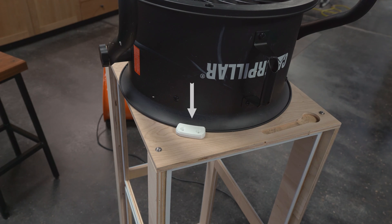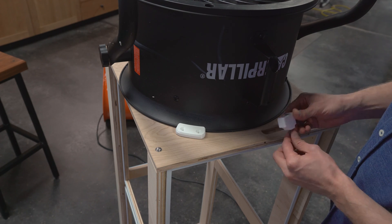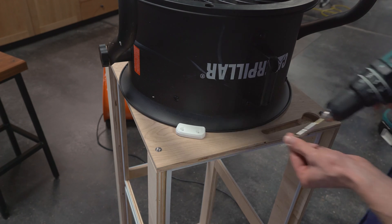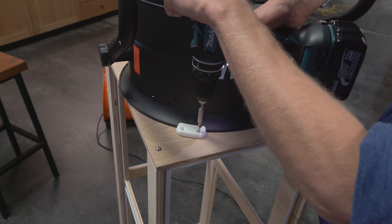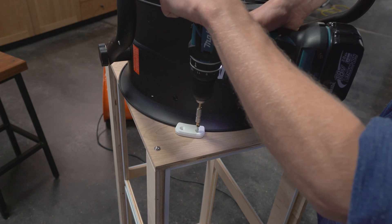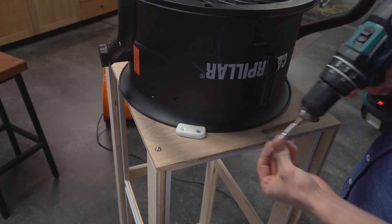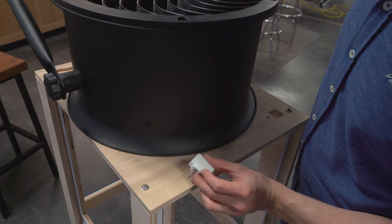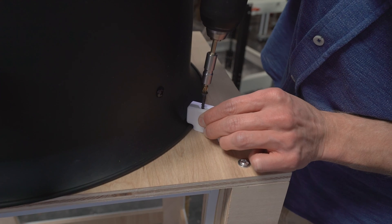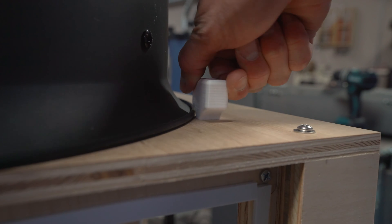The other option is my personal preference: use one of these brackets at the corner location, then install a thumb lock on the other side. This will allow the fan to be easily removed. First the bracket goes on using the 1-inch screws provided in the kit. Apply moderate downward force perpendicular to the surface using your drill until the screw bores into the wood. Now on the other side, take the thumb lock, place it in exactly this location, and drive in the 2-inch screw. This is what it should look like when you're done. If it is too hard to turn, loosen the screw until it turns with moderate resistance.